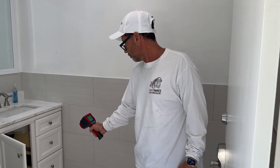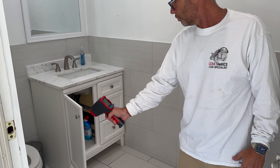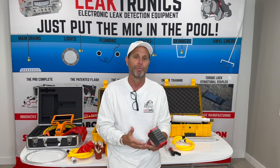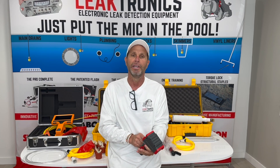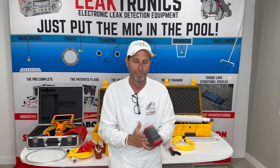I like using it on residential and commercial properties when scanning for hot water leaks. This isn't the be-all end-all. Usually you can find a hotspot; however, you would then want to use your listening equipment — whether it's the leak stick or the deck plate with the Leaktronics equipment — to back yourself up from an area that you scanned with this and what you actually heard.